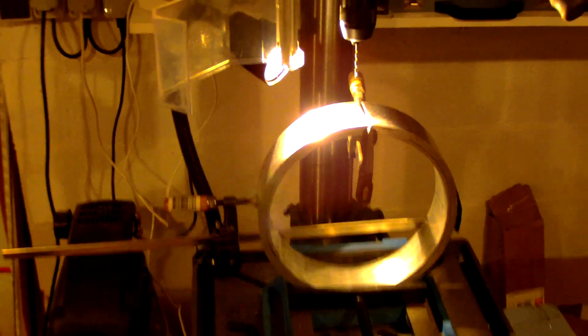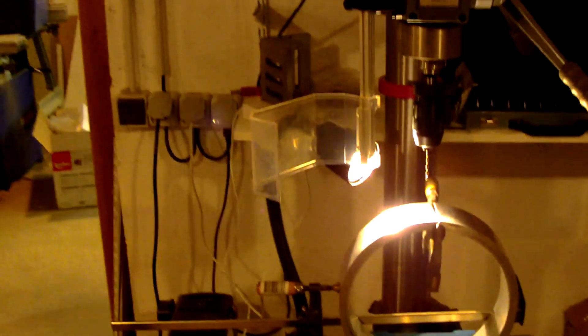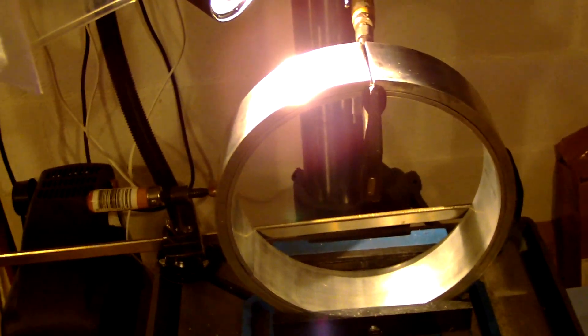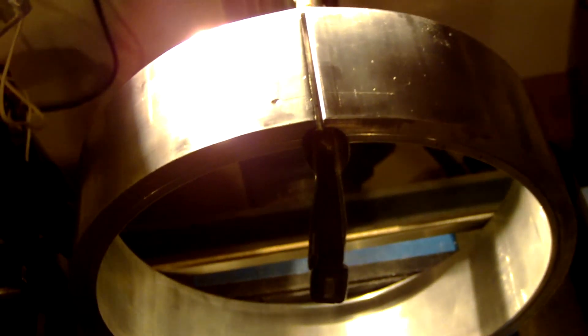For the drilling operation I use the drill press — my big drill press you can see here. The setup is made on a vise, shown here in blue, and the part is secured with two fixtures to be sure everything is okay. You can see the trace and the center drill mark already made on the drill press. Everything is secure — the screws on the vise and the fixture on the part — and we just close the cover and make the drilling operation.